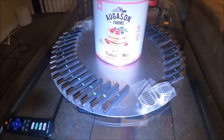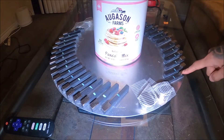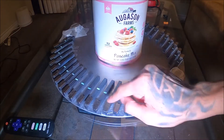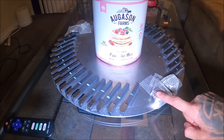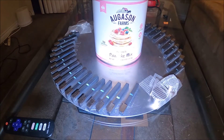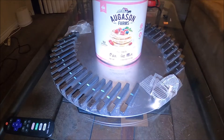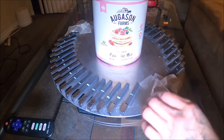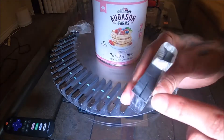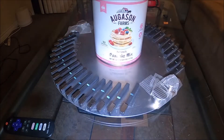We have the same setup here: the ceramics all north-facing up, with neodymium small rectangular magnets on top of the ceramic magnets. And then we have four very strong neo circular cylinder magnets, south-facing up — so all north in the ceramics and south-facing up on these two. And then we have the stator here: ten ceramics and eight neos on top.